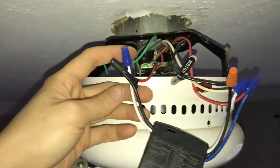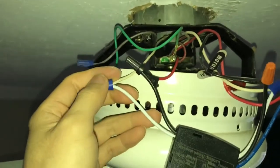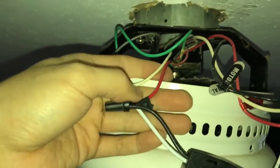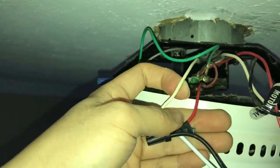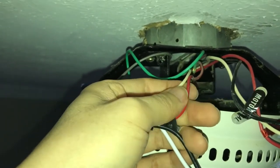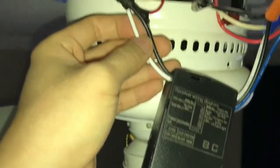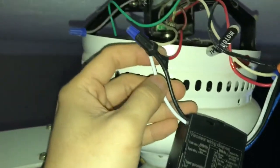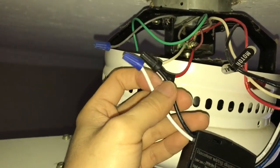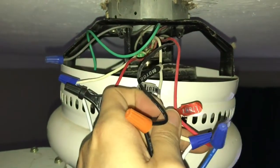So I just finished the wiring. Here is the final result. Let me repeat — because I only have one switch for the whole system, this is my neutral. This is the hot wire, also for the light switch — so this is in. And this is the remote receiver. So the two hot and neutral go to neutral and hot right there, and right here, this comes out to the fan.